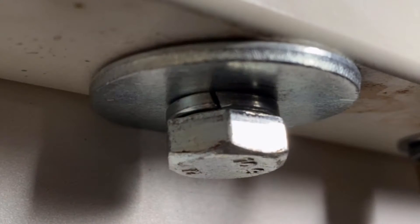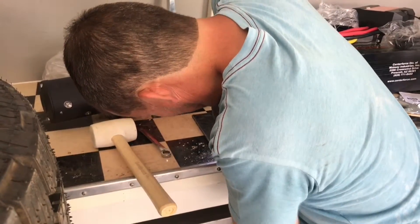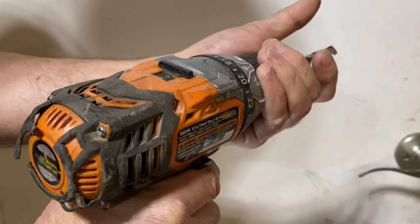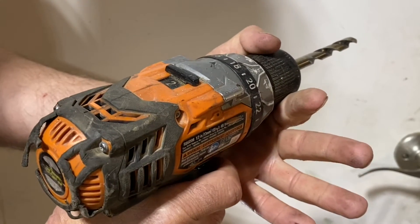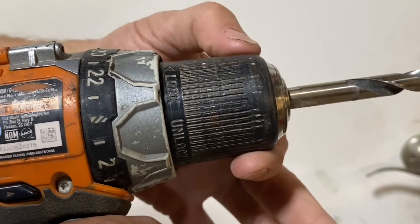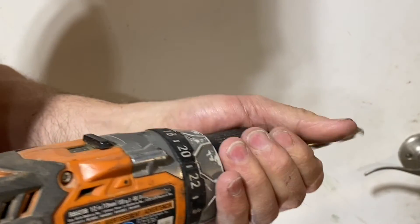For the winch itself I didn't have a choice but to use lock washers because it had square drive nuts that fit into a slot with a bolt running in from the bottom. Another useful tip: I noticed my drill bit fell out of the chuck — this has happened to me several times. On many drills, especially battery-operated ones, there is a lock on the chuck. If you turn the chuck just a little bit you'll feel a detent that locks it so it won't loosen while drilling. I've had this drill for about 10 years and only found out about that feature three weeks ago.